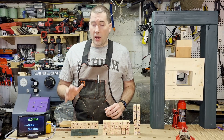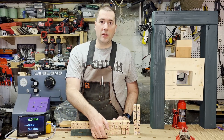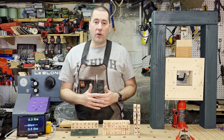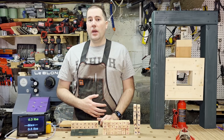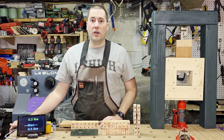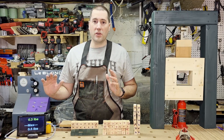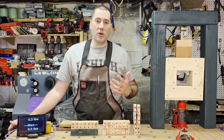I've got all my little coupons made up now and I've color-coded them depending on the load I'm gonna put on. The ones on the bottom I'm gonna put 200 pounds on, then 30 pounds, about 15 pounds, two and a half pounds, and then basically zero pounds — I'll just squeeze them together and let them sit. I'm gonna have enough coupons for seven sets, so at each load level I expect there to be a lot of variability from one test to the other. Hopefully with this number of coupons we'll be able to get a decent statistical average.